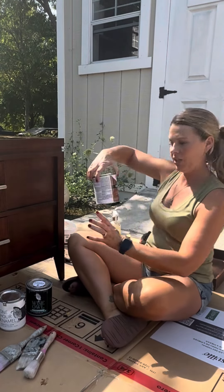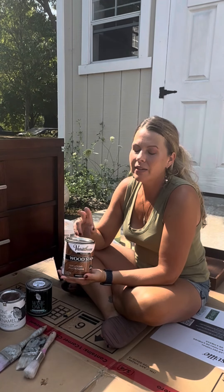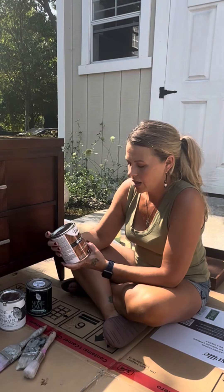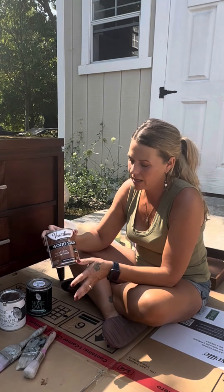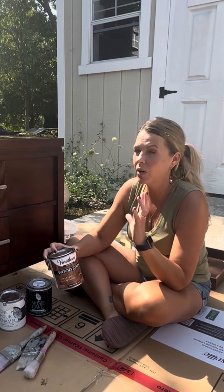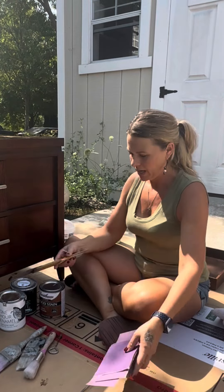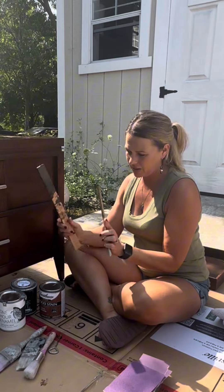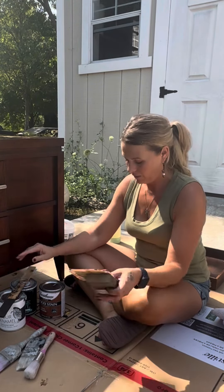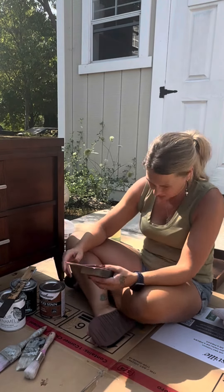For the top I'm going to use a wood stain, and we are not sanding all the way down to bare wood, so this is what I suggest: the Varathane One Coat Wood Stain. It's a little bit thicker than regular stain, but if you're not sanding all the way down to bare wood, this is exactly what you need. This will be linked. And then with your paint and stains, just grab a couple of mixing sticks and a paint opener — very simple, you can grab these at the store when getting the rest of your supplies.